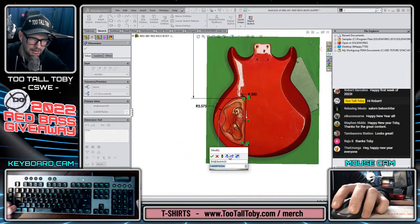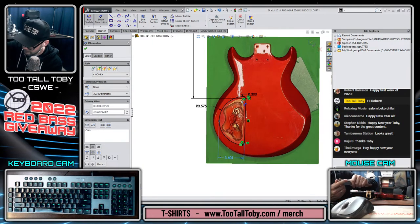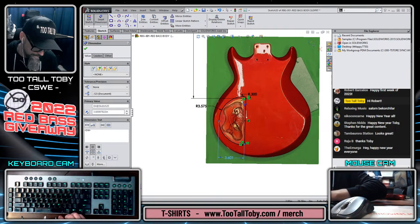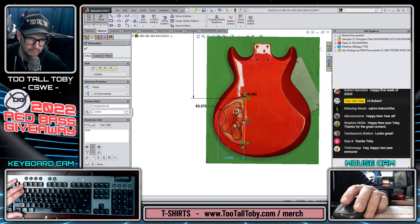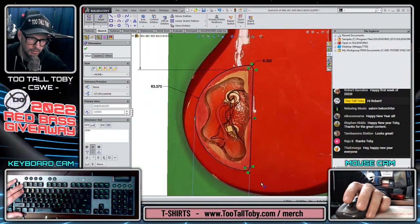Here's another spot where I could take a physical dimension. So I could take my physical caliper here and just measure that cavity from the point of max tangency, or as best as I can see it here, point of max tangency. And I got 3.63. So in the image, I'm getting 3.575. So I would need to, I'm getting 3.601. So I was getting 3.63 in the physical, and then I could go in and adjust accordingly. It's actually pretty close there either way, working from an image.